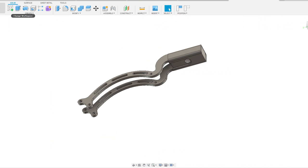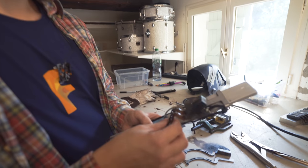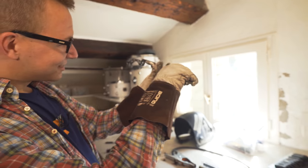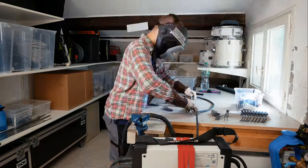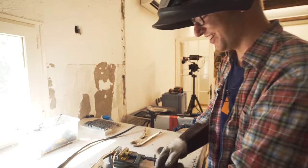I made the vibraphone arms - 11 arms, you can see them down there, this curved thingy - and then the vibraphone plate holders which will take the 37 vibraphone plates from a normal vibraphone. You can easily just pull them off and swap them around and put the notes on you want, because you only have 11 vibraphone plates on the machine so you have to change the notes to play the music you want.